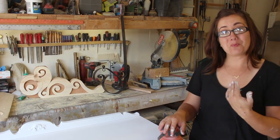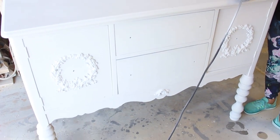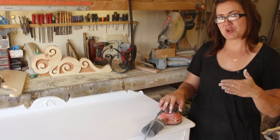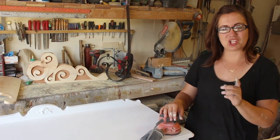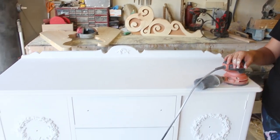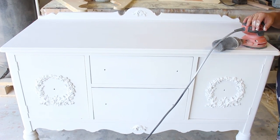We've got primer on here — I wound up doing two coats of primer and a little bit of shellac to control bleed-through. If you don't know what bleed-through is, look up my pro tip video. Sometimes when you paint furniture white, the natural tannins and water stains will come through your paint, so you seal them with shellac and paint over. Then I did two coats of our Fairy Chalk Mother Snowflake color. If you'd like to buy that, stop by JamieRaeVintage.com.